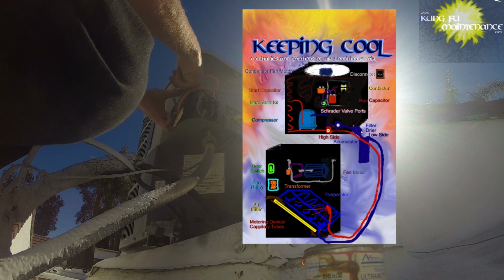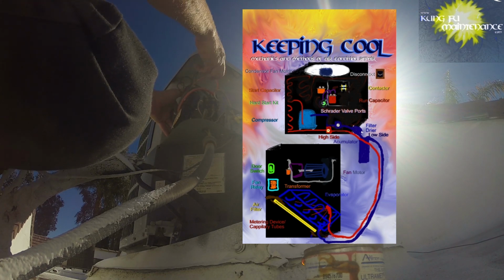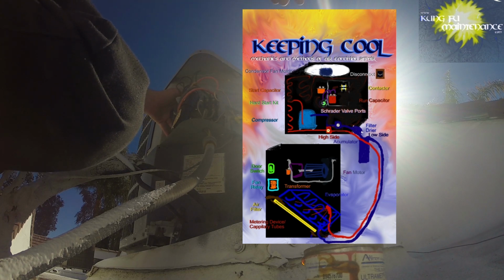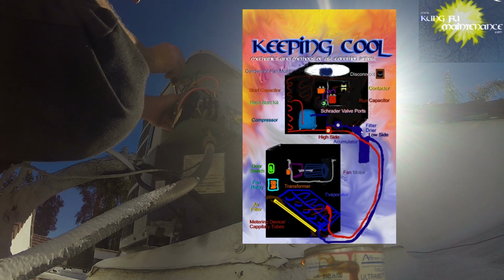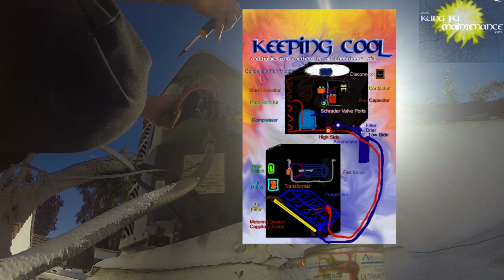And I have definitely had a lot of units that had trouble starting and adding a hard start kit, even on fairly new units, just made the compressor's initial start more reliable. So that's been my experience.